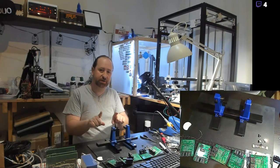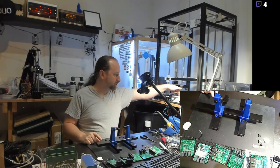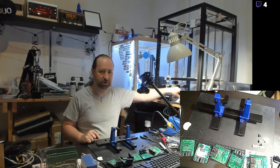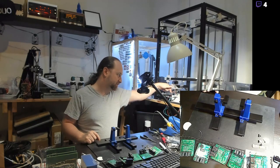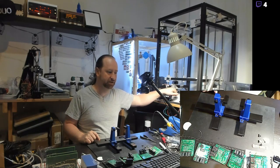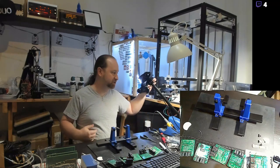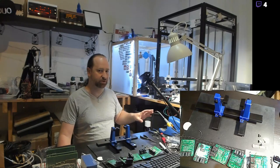The cool thing about that is you can run the entire web interface from the ESP module that's in there. Everything that the ESP module needs to run a web interface can literally be loaded on the ESP itself. Of course, the Duet has a lot of that stuff on the SD card, but I would like to see somebody create a nice generic web interface just for the ESPs so that the onboard firmware can be completely separated from that.